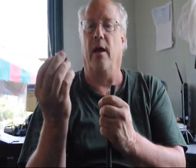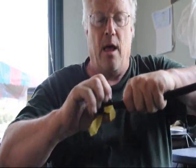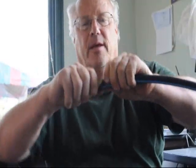And this is your connector to the garden hose. It has a little nickel with a hole in it, and we use that where needed to reduce the pressure. What I do is I pull this valve stem back all the way, push the compression fitting on as far as I can, and then turn the knob. And that tightens it up. That son of a gun is on there. That can take quite a bit of pressure before it'll come off.